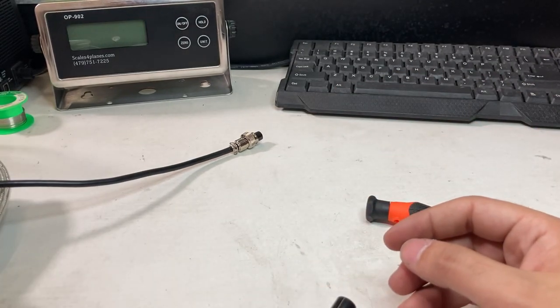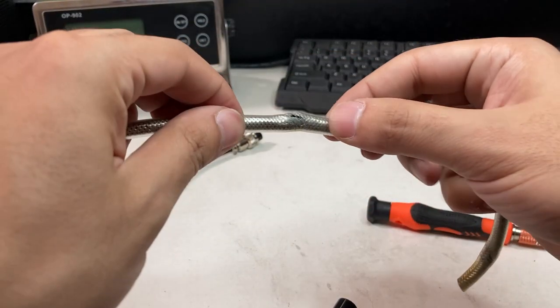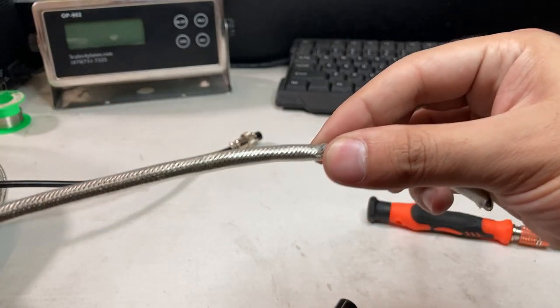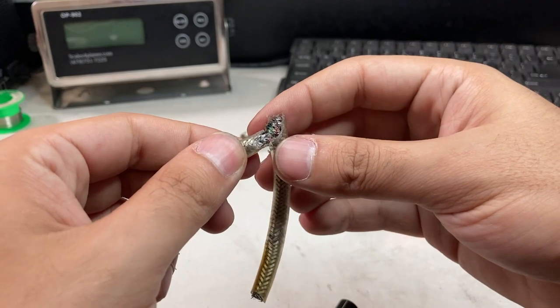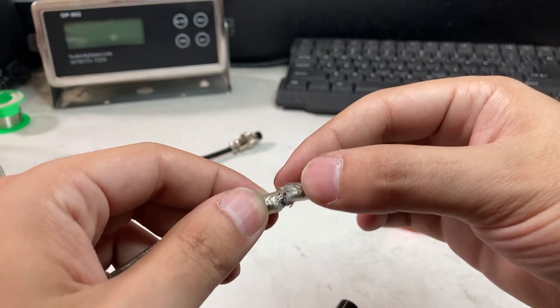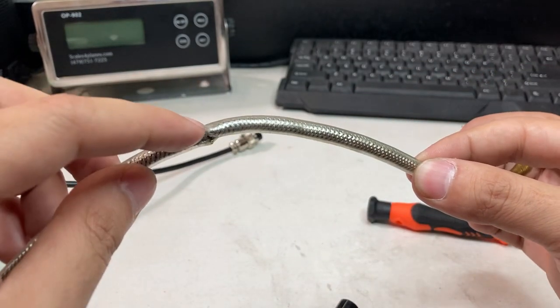Make sure you go through the entire cable. I pulled one a while ago and you could see how it was smashed in one area — so run your hands along the entire length of the cable. It also had a cut in it, and this could cause a no-signal problem where you put weight on the scale, take weight off, and it still stays at zero. So make sure the cable is fine.